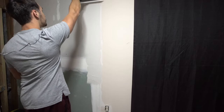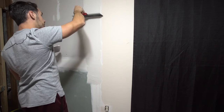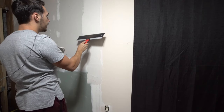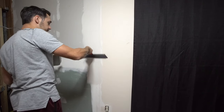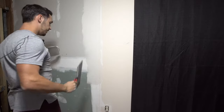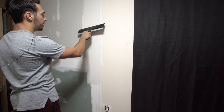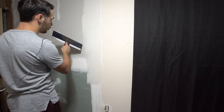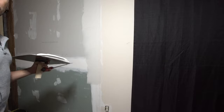If we look now we're a lot more even. There's still some light coming through, especially up top where I can't get a lot of mud, but over here we're just about filled in — right there we are completely filled in. So I can feather that out and it'll look great when done. Take the edge of the knife, make sure it's flat against the wall on the left, keep the other side even with the wall, and just really feather it out. You can see it takes off all the corner edges of the mud. I'm going to cut the video here because I need a step stool and can't get the top with a ladder in the space.